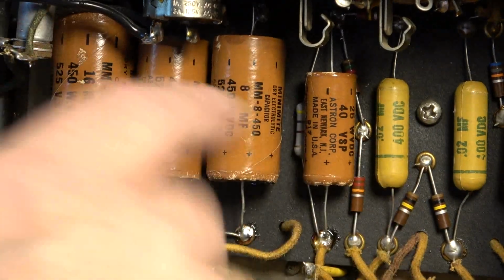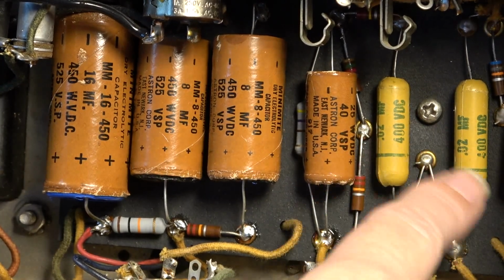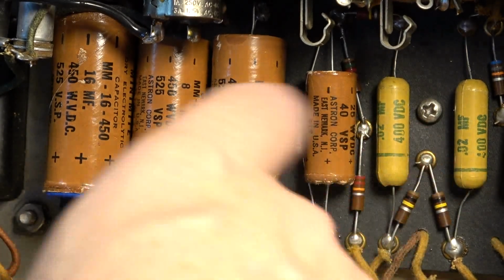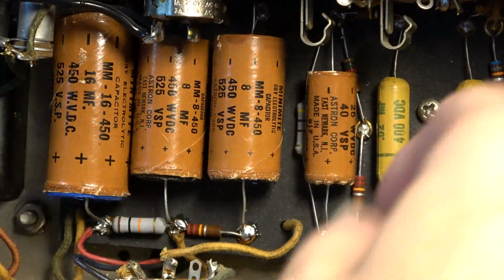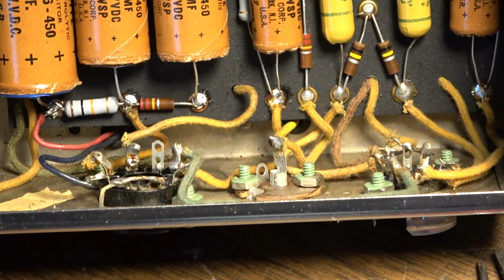I'm going to fire the amp up. I'm going to test these capacitors in the circuit. My guess is they're not good; these are probably going to be leaky. They usually are. I went ahead and crimped the RCA jack a little bit to tension it.